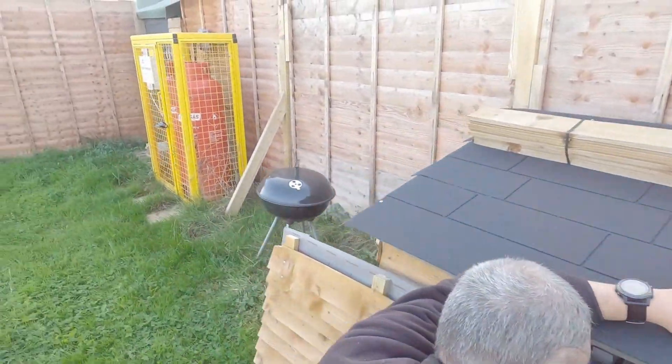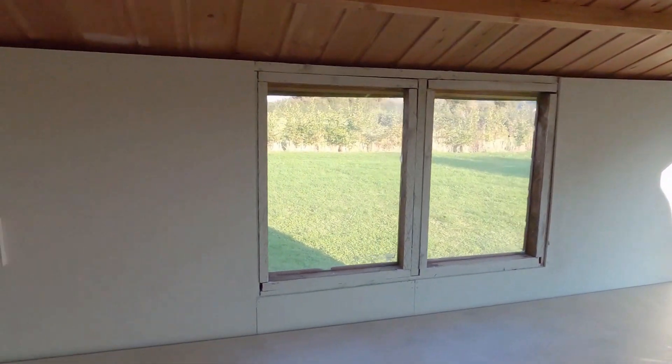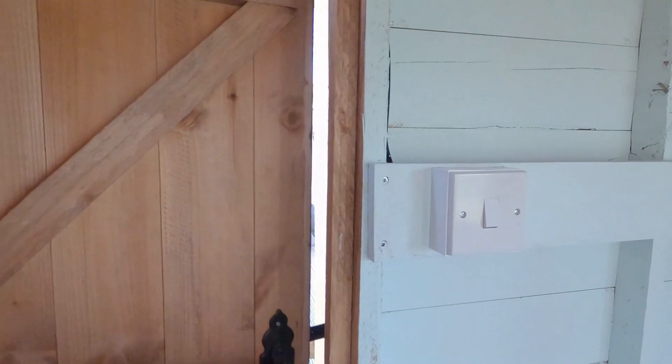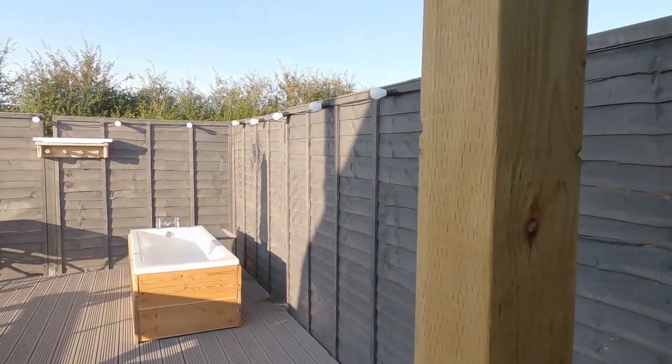This all runs so we've got power into the boiler. The whole kitchen setup is 240-volt — there's the boiler isolation switch and the fridge. There's actually a normal plug socket behind here but we've hidden it because we were concerned that guests would plug in hair dryers, straighteners, and all sorts, wasting the power. We've decided to just keep the fridge plugged in. The outside lights are still on the 240-volt system, and then into the dome it's just the 12-volt.